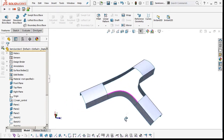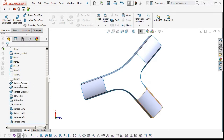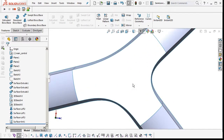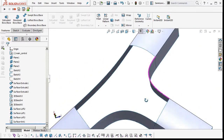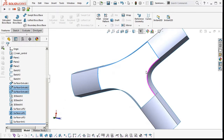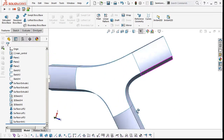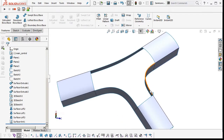What we're going to attempt here is a three-arm junction which has an N-sided surface — N being number six, six edges in this case, a six-sided boundary. In SOLIDWORKS you could use a fill surface and use a cross curve to control it, but I prefer to do this the old-fashioned way using four-sided surfaces and trimming to get the result.